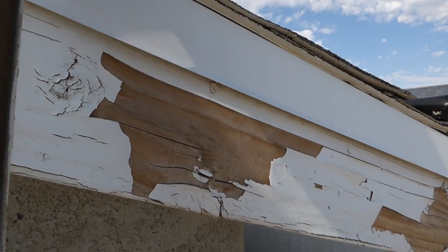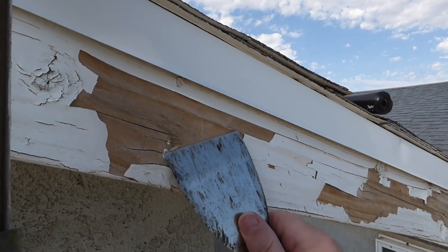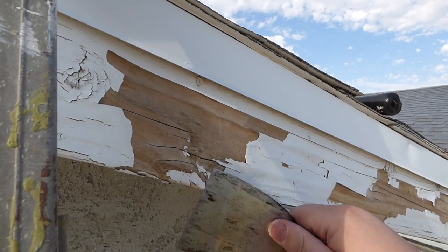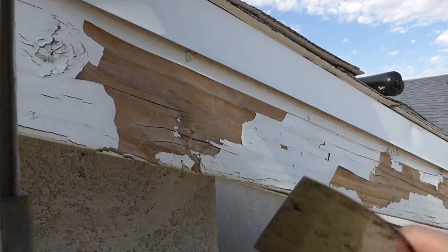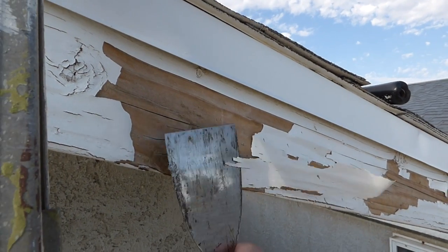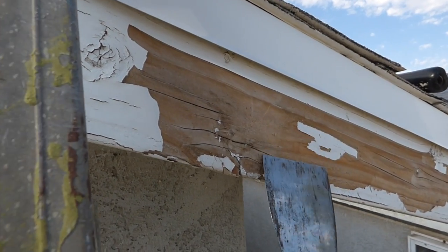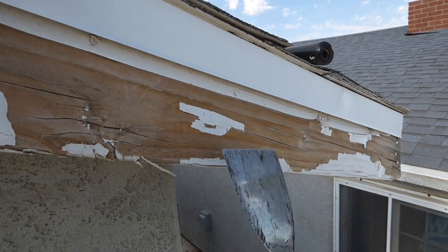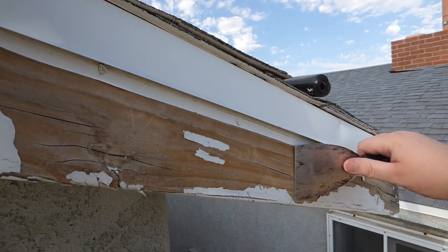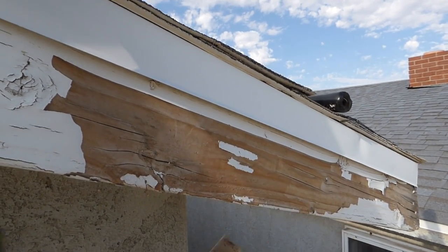What we've got here is a failed attempt at painting these eaves. This here is the wood, this here is some old paint. I'm scraping this with a mask on, eye protection on, and doing it very daintily right now. The point is I want to get off this old paint that's kind of built up and fulfilled its purpose. A lot of places on this, the paint's already weathered off. I just got a little scraper here to work the paint. If something's really stuck on there good, that's fine — you don't need to worry about it, just the stuff that's not.